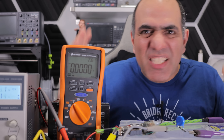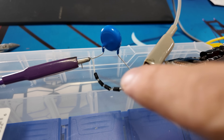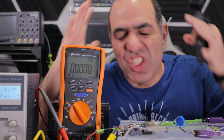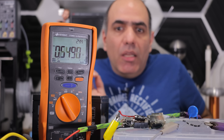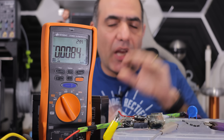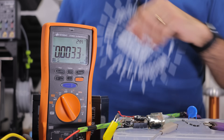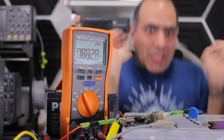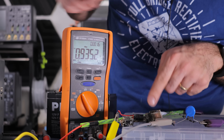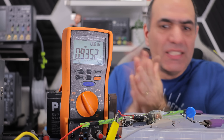Screw all the noise and messiness and complications with AC. I just added a series of high voltage diodes and a capacitor to rectify the AC output of this device, and we will be just measuring DC. So we just turn it on. The output voltage is already above the 15,000 volts rating of this capacitor. Let's reduce the supply voltage. 0.935 — so we are measuring above 9,000 volts.